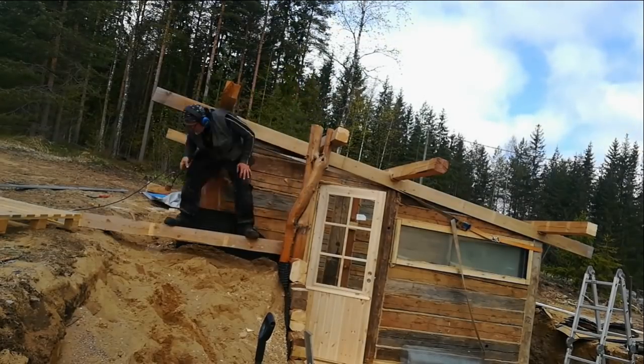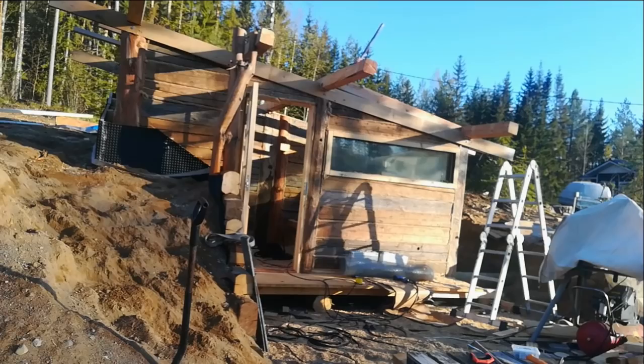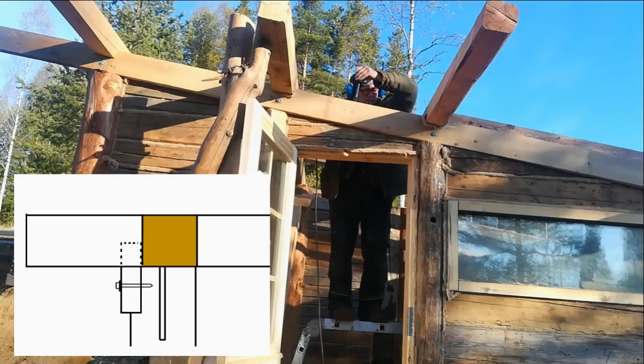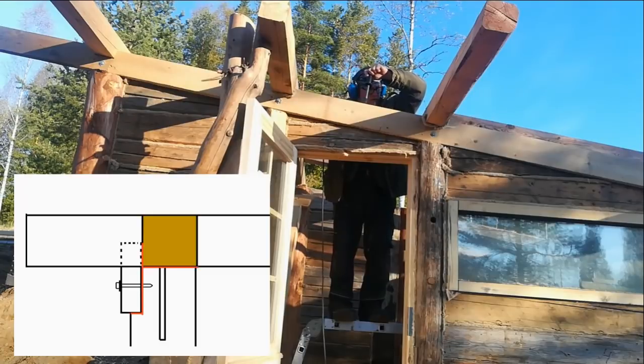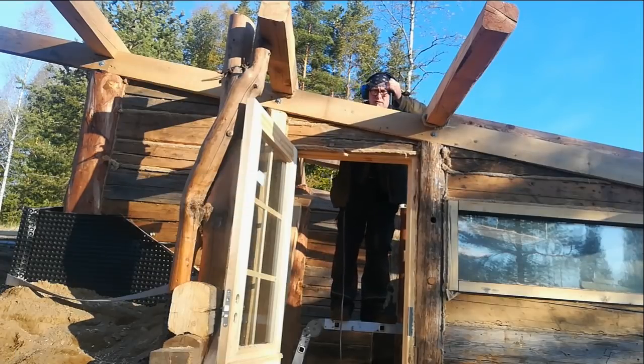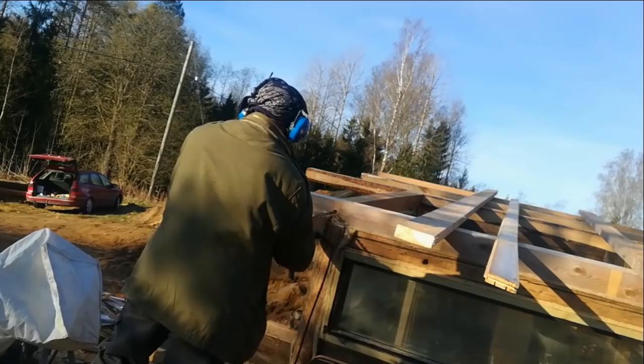So then with those beams in place, I'm going to infill the gaps in between with the same stuff, 15 centimeters by 15 centimeters, on top of the walls. Remembering, of course, as always, get insulation in between there. And each section, as it goes in, gets attached to the beam above or to the left of it, and below or to the right of it.